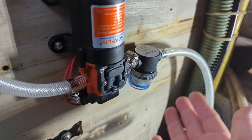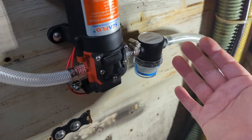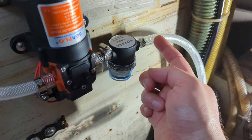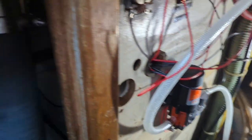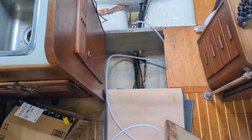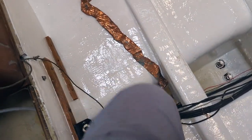The pump says it's dry-priming and there was water in there — you saw a little water spitting out earlier. I overbought on this 3/8-inch hose since it was much cheaper to buy 50 feet than 20 feet, so I bought a whole coil and I'm hooking it up directly to the strainer, running it inside the boat and down into the bilge. My theory is that the pump needs the higher volume capacity of the bigger 3/8-inch hose.